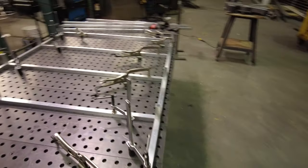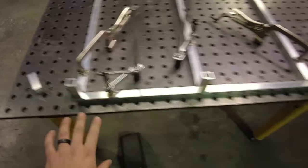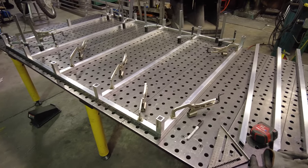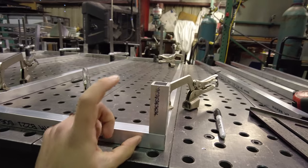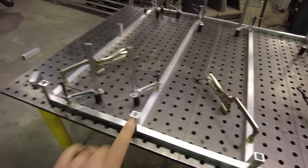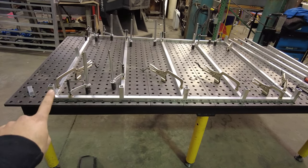This is the base of the rack. As you guys saw, 45-degree cuts to the ends, got the cross pieces in there. Everything's clamped perfectly square. It's not really going to be a very tall rack — it's going to be five inches overall. Pretty simple. We're going to go ahead and tack this whole assembly together and then probably add the upper bars.